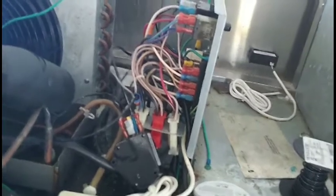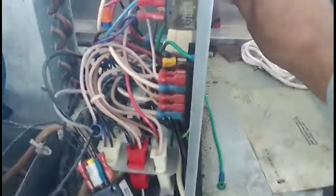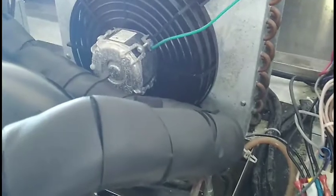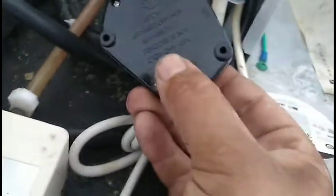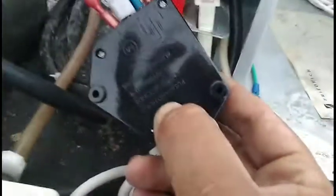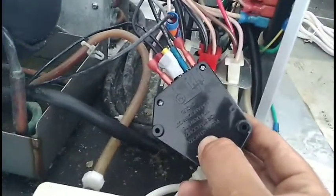We're going to plug it in and see if it becomes alive. The evap fans, we just plugged in. Evap fans are running. Here's the thermostat. Compressor turns on. All right. Let's test our defrost. So what we do is we hold it here 30 seconds. The longest 30 seconds, I would say, when you're filming it, and everything should turn off.